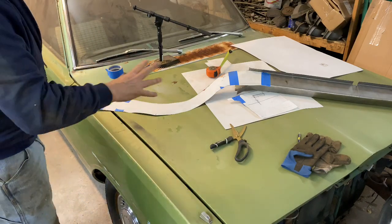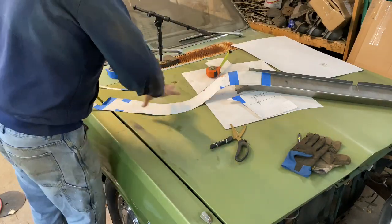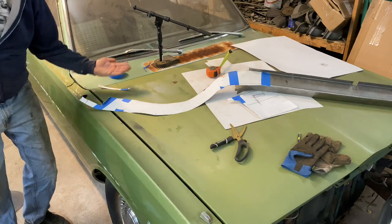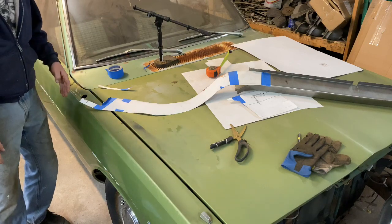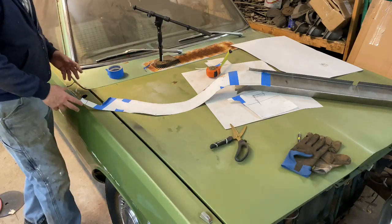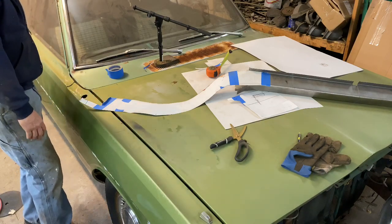So getting into a little bit of suspension geometry, I've spent a lot of time studying it, and I'm thinking through torsional geometry on the chassis and where my points of concern are, and I'm not concerned about that much. It's all going to be in here where that is pounding up on that frame. So hence why I designed this to drop that box tube in, maybe plug weld, I'm not sure. We'll figure that out as we go, but I kind of had this loosely in mind, even though I didn't spend a lot of time designing it. I didn't lay all my cards on the table early on, I suppose. I tend to have an intuition on what needs to happen and then just build it as I go. Plus I've got to leave some surprises for you guys. I can't throw all my tricks on the table in the beginning, right?